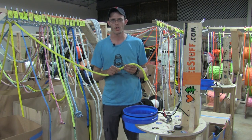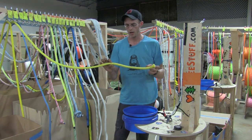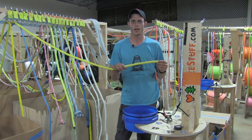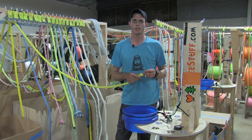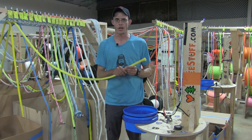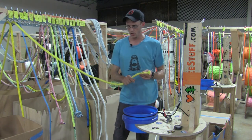They won't hockle, twist, and jam up your hardware. Personally, I prefer to rig with 24-strand double braid lines. However, you will need to use a block in most cases because they don't handle abrasion as well. That's 24-strand.